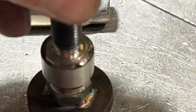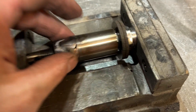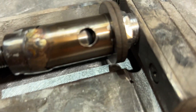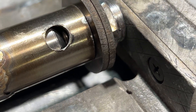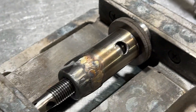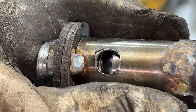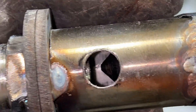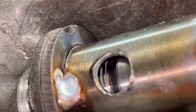I could do a grease test and look at the fit, but I ain't got time for all that. I hope this strategy works. I'm just going to turn this until it just touches. I'm going to weld that right there. You can kind of see the valve seat in there — just touching. I'm going to get a little tack weld here and there, and we'll jam it, bam it. So here it is. That's fully open. And that's closed with a nice valve seat.